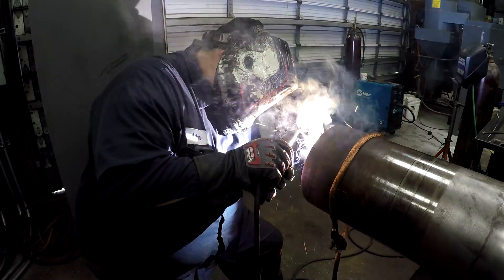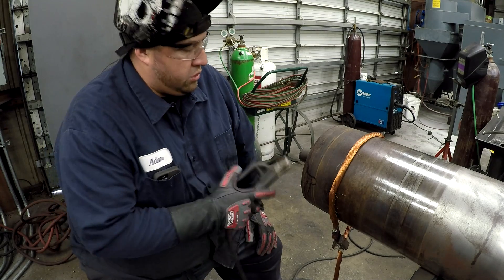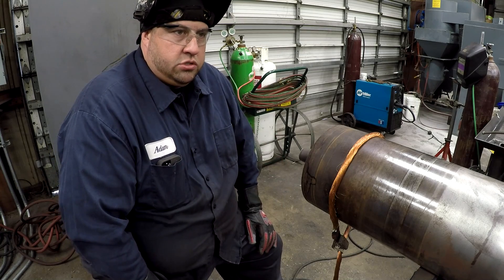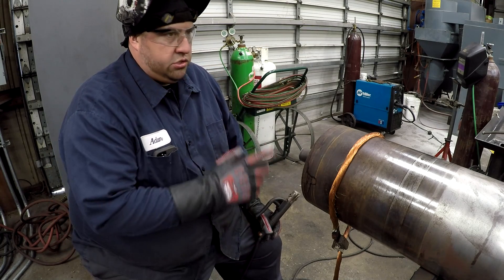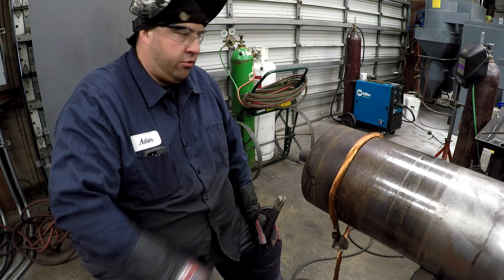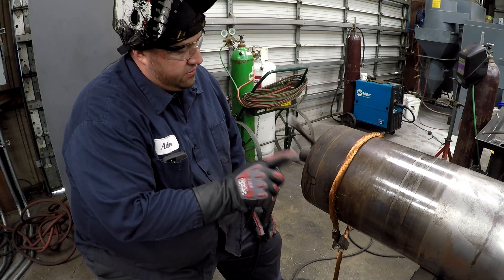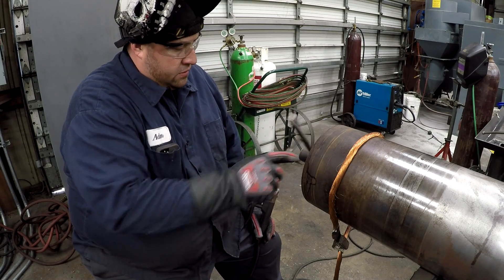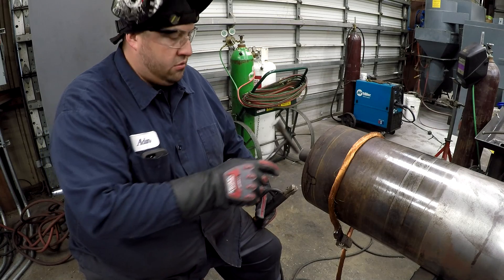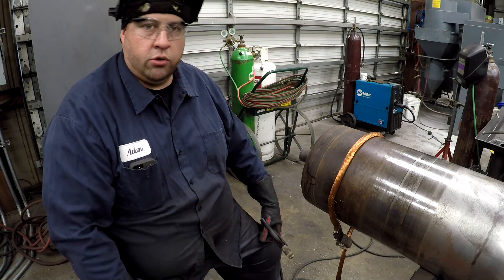I'll give you a couple clips. Once I go all the way around, you come back around to your start, which has got the flux. Typically what you do is just try to weld past it — you weld over the top of that flux and it starts burning through and it'll flow down in there. Once you start your next pass, you start it past where you ended and come around over the top of where you tried to flow it together, and it'll all blend together really good.